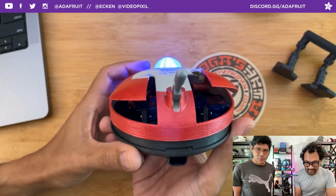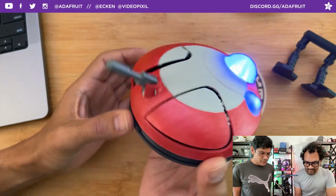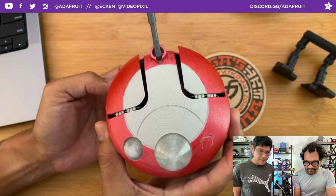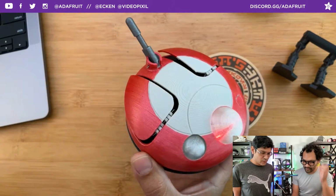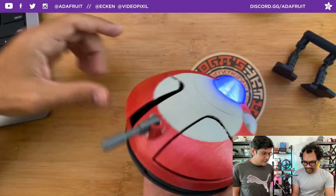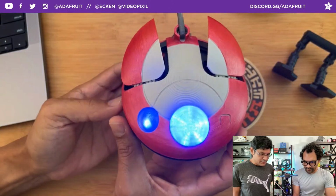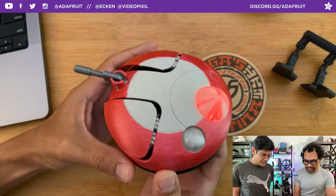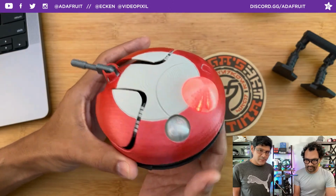Cool. So it kind of resembles those robots from Batteries Not Included, but also kind of like a ladybug. It's got these two wings that are servo controlled, so there are 2 servos. You have 2 sort of eyeballs here. They have NeoPixels. One is a NeoPixel button, and the other one's a NeoPixel Jewel, so you've got a total of 8 NeoPixels. It's running off the Itsy Bitsy RP2040, that lovely board with tons of GPIO pins. It's great for embedded projects, and it's all running CircuitPython.